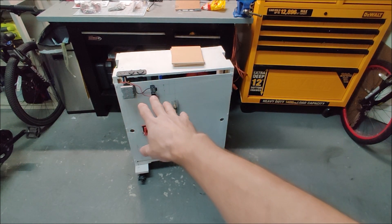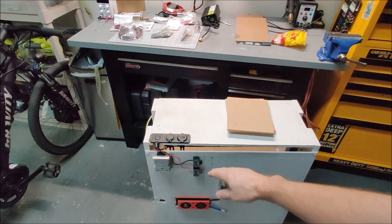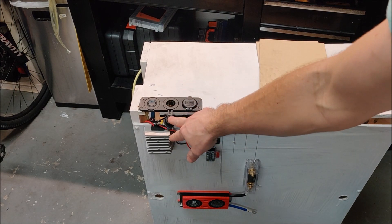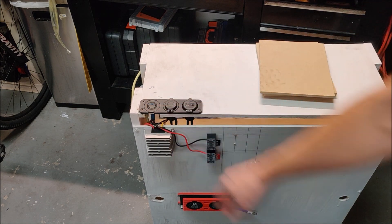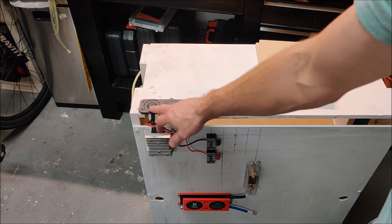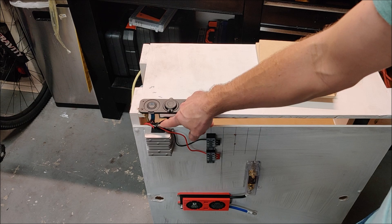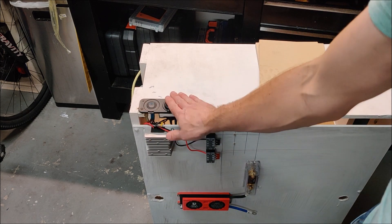This is going to be some 12 volt circuitry. I'm using one of these automotive style racks — there's a 12 volt socket, a USB with a meter, and a switch. I've rewired it so 29 volts comes in through the switch, which sends the voltage into a DC-to-DC 12 volt step-down converter. 29 volts comes in, 12 volts leaves, going to both the USB and the 12 volt socket for regulated 12 volts.